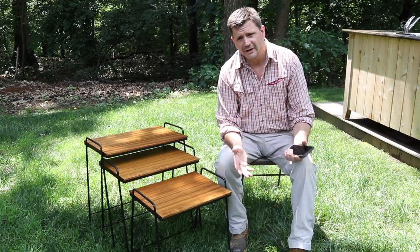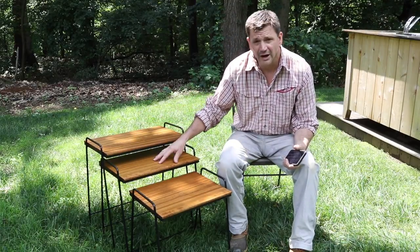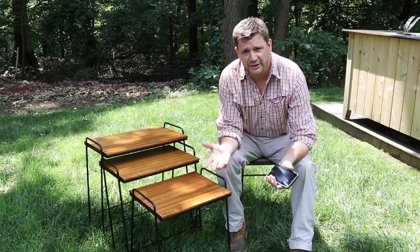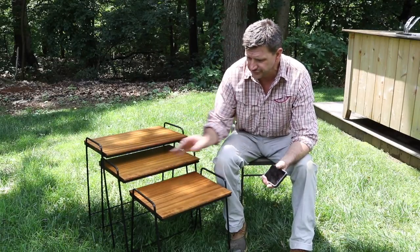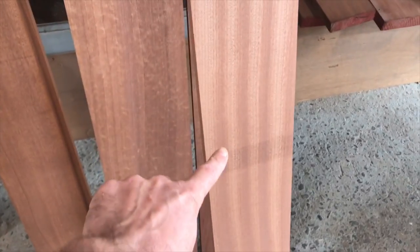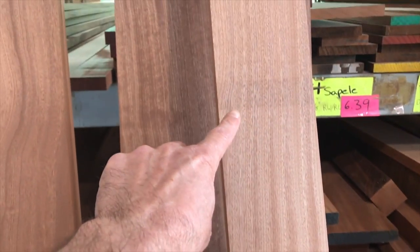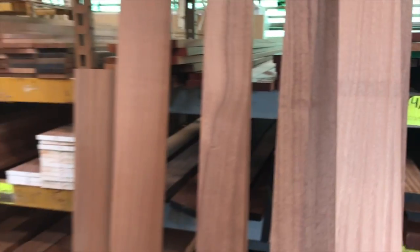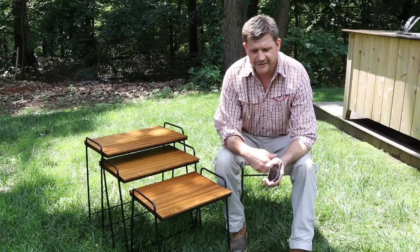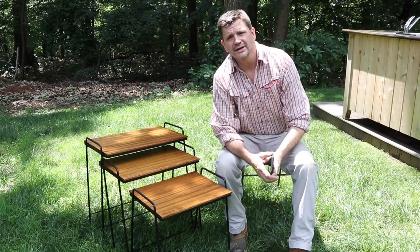Lastly, I want to mention my Instagram — if you're not following me, I hope you'll check it out. I like to post updates on projects and helpful hints. This week when I was picking the Sapele for the tops, I came across a board with sticker stain. What that is: when the wood is drying, if they use wet sticks between the boards you'll get a sticker stain, and that's a board you want to avoid because you'll never be able to sand those stains out. Those are the kinds of things I like to post on Instagram. As always, thanks for tuning in and I'll see you soon.